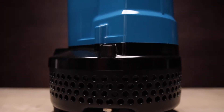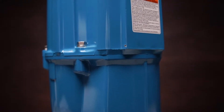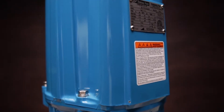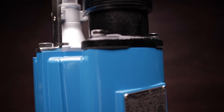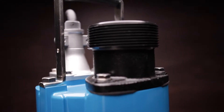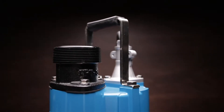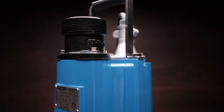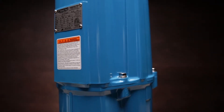The NK2-15SK is a 2 horsepower, 115 or 230 volts switchable, single-phase high-head submersible pump that draws 23 amps at 115 volts and only 11.5 amps at 230 volts — extremely low. It comes with a 3-inch NPT discharge, a 32-foot power cord, and weighs 80 pounds soaking wet.